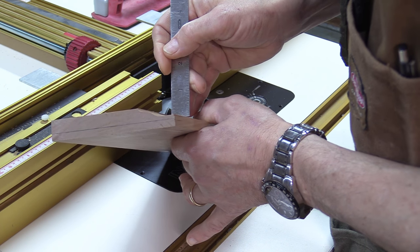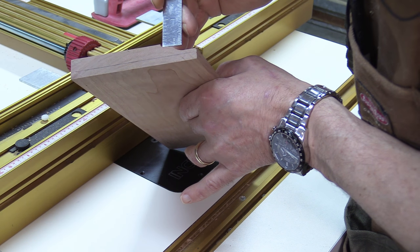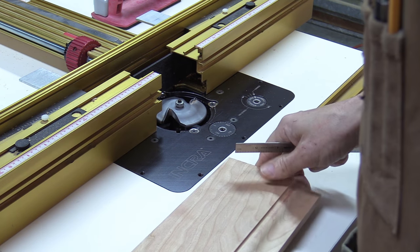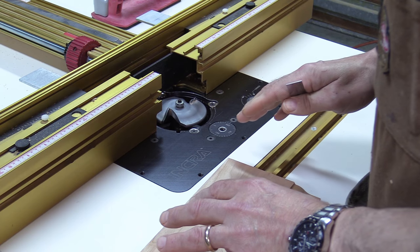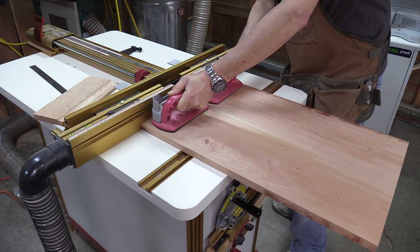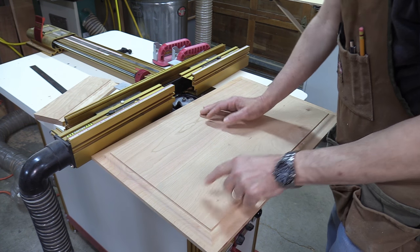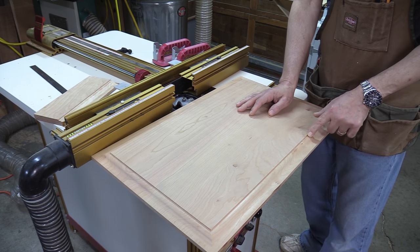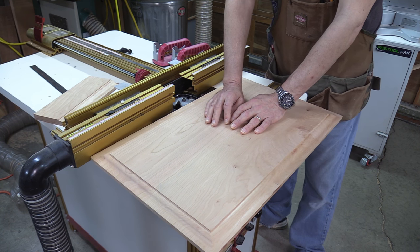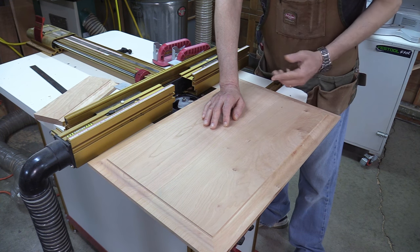That first test cut left me just about an eighth of an inch — it's just a little bit shy, but that's good and I'm going to keep it. So I'm going to take the panel and run the end grain first, then the long grain. Here's the panel — it came out very nice. I expected a lot of burning on the end grain and actually didn't get any. I did get some burning on the long grain, so I'm going to raise the bit up maybe close to a sixty-fourth of an inch and run it again — that'll take care of the burning. If there was any burning on the end grain, that would also get rid of that.